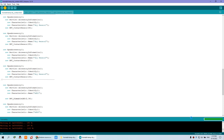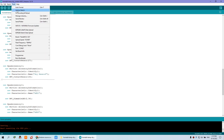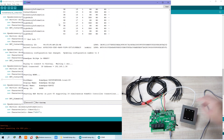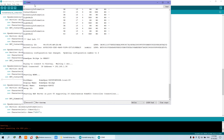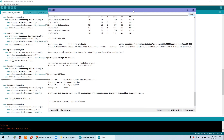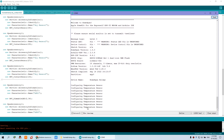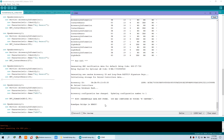We just wait for a moment. Okay, you can see it is complete. Now we can open the serial monitor. Because I have configured this file before for this board, the first time I need to input 'E' to erase and clear all data — so I click Send. You can see: erase, restarting. The temperature sensor is configured and now HomeSpan is ready. I used 'E' because sometimes you want to change the WiFi or move to another place — you can use 'E' to erase all information. Now you can input 'W' to configure the WiFi SSID and password.